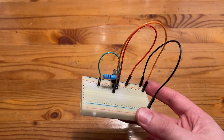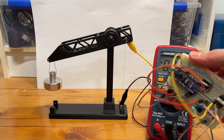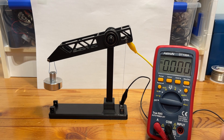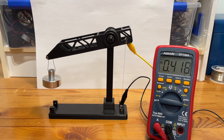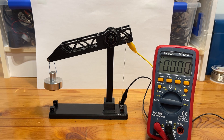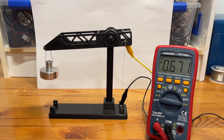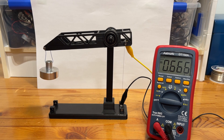Despite the slightly goofy looks, this should work so let's wire this up and get a real test done. I have an ammeter connected in series with the wire so we'll be able to see if the current we calculated is actually being supplied. I went ahead and added a MOSFET controlled by an Arduino programmed to cycle on and off in five-second intervals. The current seems a bit low — let me give it a second to warm up. I swapped out the 2 ohm resistor with a 1.6 ohm resistor and upped the voltage to 9 volts, and that is the actuation speed we're looking for. It legitimately feels like magic — it's completely silent while actuating, which is way weirder to witness than I was expecting.